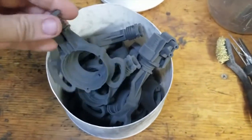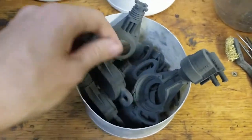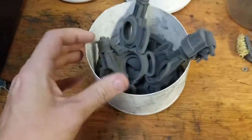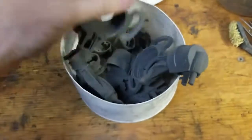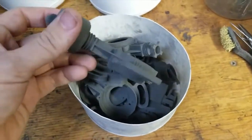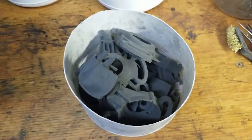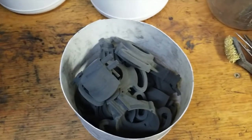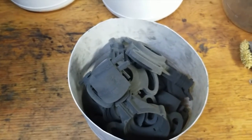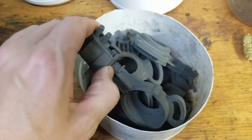Here's the output of that 800-some layer job. I've cleaned up some of these, though I still haven't totally finished. It just goes to show how much you can nest in there — this is about a gallon container cut in half, and I've got parts on top of parts on top of parts going all the way down. I'm pretty pleased. Aside from the overheating issue, I'm going to bring the temps down and calibrate — find that Goldilocks zone. I think around 173.2°C will be my next shot, because 173.9°C was just too much.